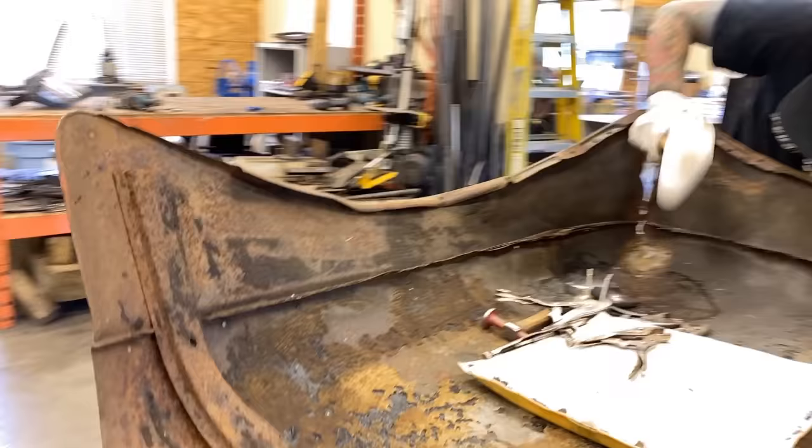Like if you've got a big sink, like maybe something fell in the middle of a roof and it came down, you really shouldn't touch the center of that very much. All your work is going to be on the outside, and the reason being is that that's where the damage actually happened. That's where the shrink and the stretch affected the metal permanently, and you have to reverse that to get it fully flat. So of course you're going to undo the dent like we just did, but all the spots where the hard bends are is where the metal's truly affected. The rest of it is going to, for the most part, try and hold its form. The piece wants to be the piece it was. You just gotta relieve the spots that the most tension is, and that's all those crinkles and those bends.